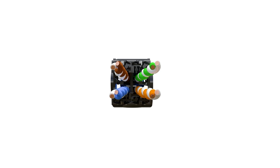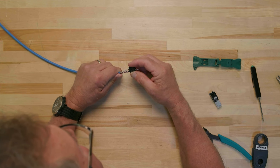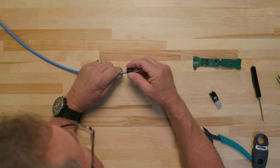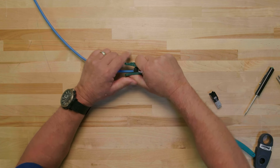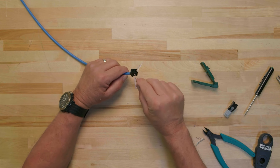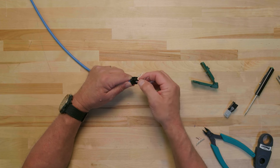When terminating cable end 2, position the cable so that the brown and green pairs are oriented in the same direction as the strain relief, the catch, and the retaining latch, and insert them into the wire cap. Be sure to always maintain this orientation and positioning throughout the entire termination process. Continue to follow the same steps as cable end 1 until the strain relief has been depressed.